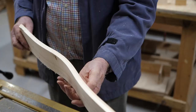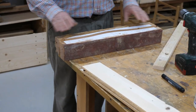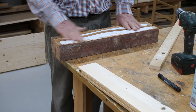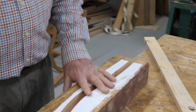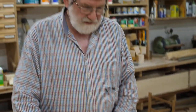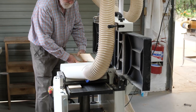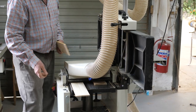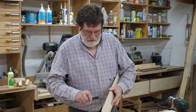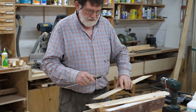The next one we'll look at is the back of a chair that we've been making. This is a very old piece of wood. We plotted the shape on the computer, stuck it onto here, and just cut it with a bandsaw — that's given us the shape we're looking for. For that we're going to need quite thin timber because it's a double curve. We'll use these bits of spruce and plane them down to something in the region of six millimeters. We've now thicknessed these down to about four and a half millimeters, so we'll try those.